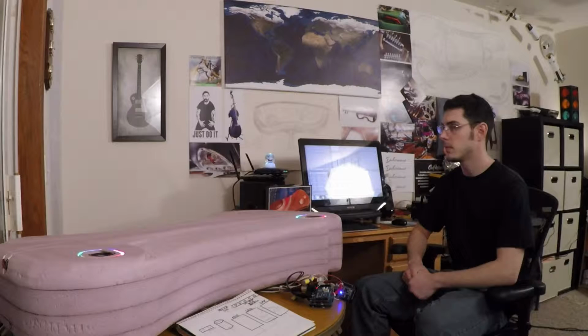Now that we've showed you how this works on a proof of concept prototype, I want to tell you a little bit about why it's not working, and it has a lot to do with the sensor quality, which is the reason that we need some help getting the quality level of the sensors and components that we believe are necessary to pull this off in a concert environment. One of the biggest problems I noticed right off the bat is that we get a lot of electrical interference across the sensor lines. It could be caused by a number of factors that right now cause the sensors to send a lot of erroneous data.